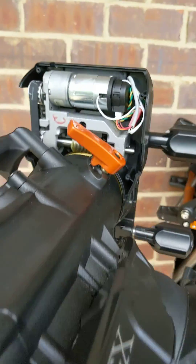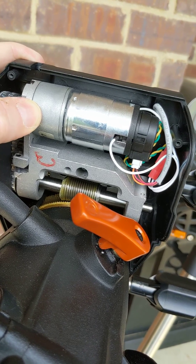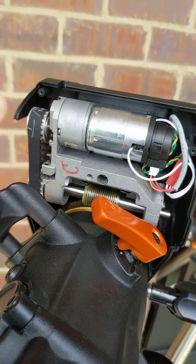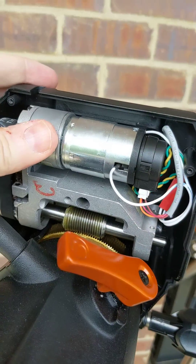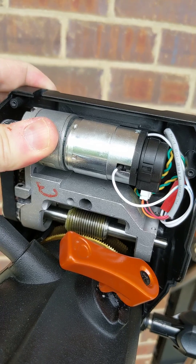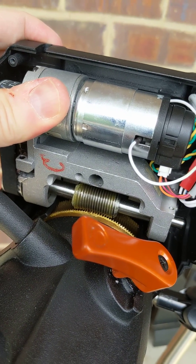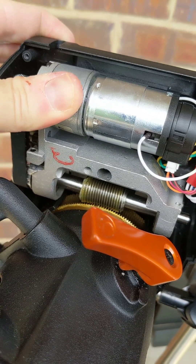Trying to do the same thing down here. This whole mesh has got a little bit of play in it, just to give it some breathing room — makes sense, good design. This one's just way off. But when you press on this, you can see there's a little bit of play as well, because this action is pulling that worm off the worm gear. So there's a little more space between the sprocket and the teeth.